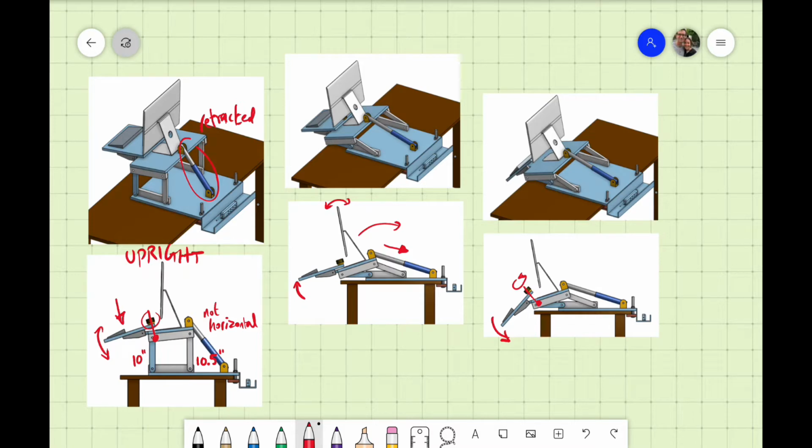If those 2 struts had been the same length, which is how they had been up to this point, then the upper surface would be horizontal, if you can imagine that, and then as the thing pulls on it, it's a little bit hard to describe, but basically this distance here, that green I just marked, that is the moment distance that this thing has to pull and generate a moment to raise it back up. And if you didn't have that extra advantage, you get a much shorter moment arm.